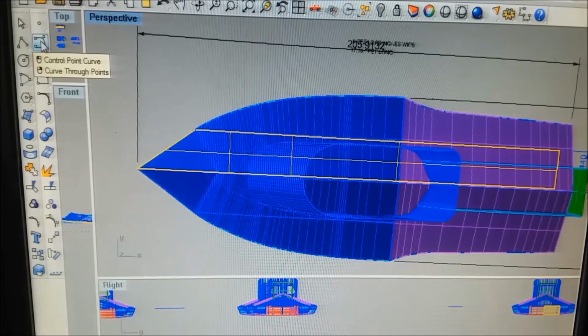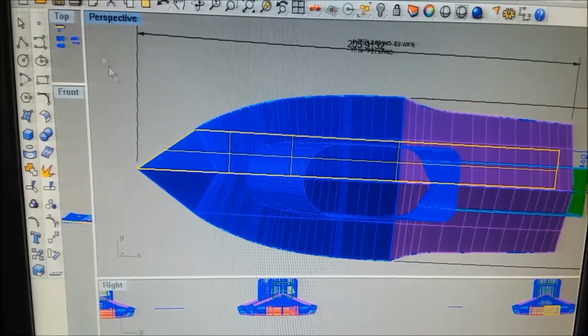If I turn points on, and I'm not sure where to do that, it's a command you enter up here. I don't ever use it, so I think maybe it's just points on. Anyway, it'll show you the points. There'll be a point here at the end, maybe two of them close together. Then there'll be one up here someplace, and then one here. The point up here tries to drag that curve up, and the one back here starts dragging it back down. If you want it to go through a particular place, you put two or three points together. Like 2 points here, the point that you want, then a couple points going down. Then a point down here someplace and a point back here and one at that end and a couple behind it, because you're going to trim them all off.